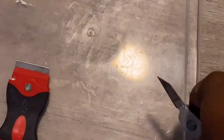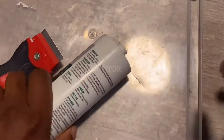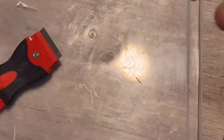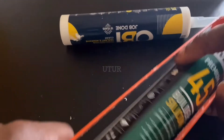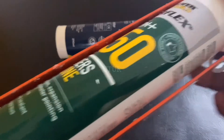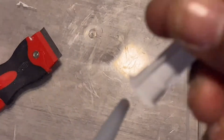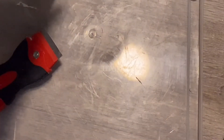To open the nozzle, get yourself a Stanley knife and cut the tube head, then cut the nozzle head — take care not to cut yourself. Make sure you leave some room so you can screw the nozzle back on. Once done, insert the cartridge into the chamber of the sealant gun, press the lever so the piston can latch onto the suction of the cartridge embedded within it. Then cover the nozzle with the nozzle cap to prevent the sealant from curing or air from getting in.